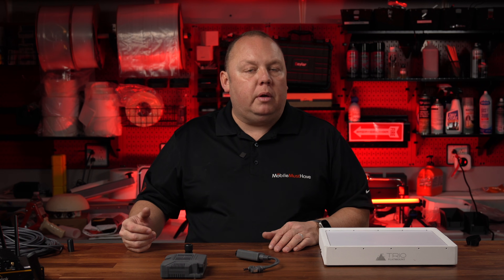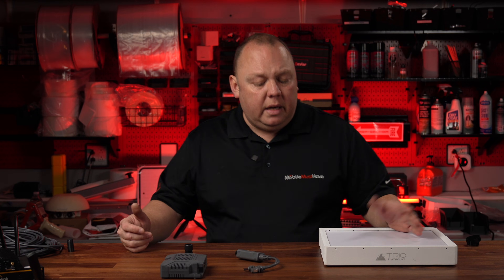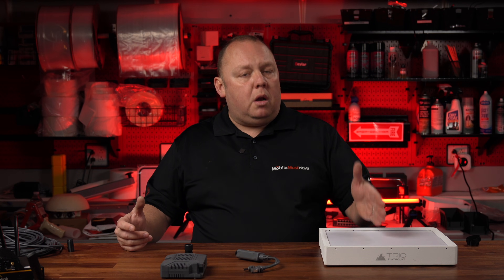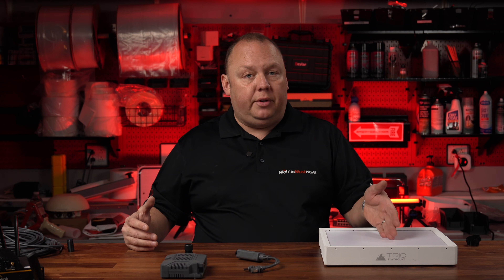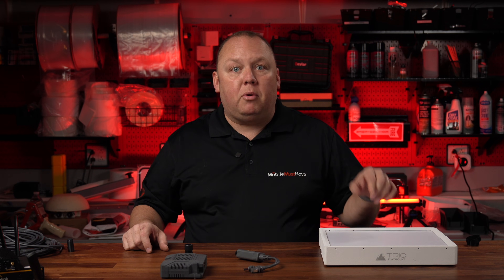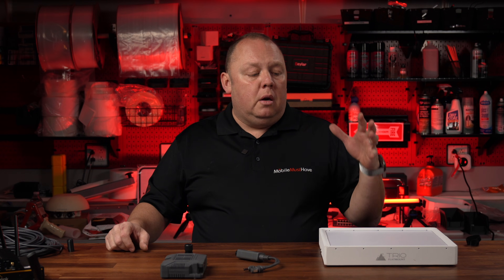they decided to make it DC powered and not really worry about power over Ethernet. Kind of odd, because the unit accepts 48 volt input, so they could have gone with a PoE application very easily, but for whatever reason they didn't. So that left us with a hole in the need for this product — because if you want to pair this with a Peplink or any kind of high-end router to make this actually awesome, so that you can bond it with cellular, set it up with multiple Starlink dishes for added redundancy, or just use it as a single dish with a better router. If you actually plug a Starlink into a Peplink and enable certain features, it actually makes the Starlink perform better — things like forward error correction and other stuff that you can do on routers like that, allowing these devices to perform a lot better with the packet loss that's just known to be there with low-orbit satellite internet.